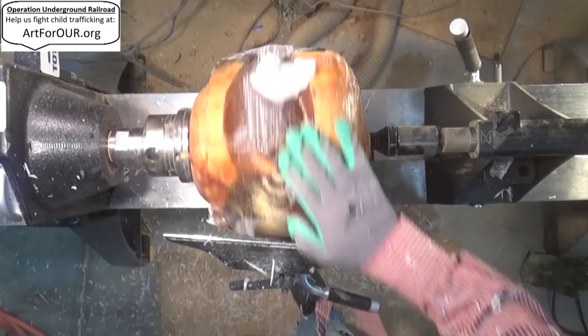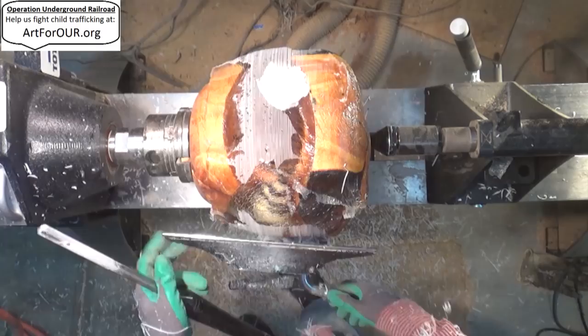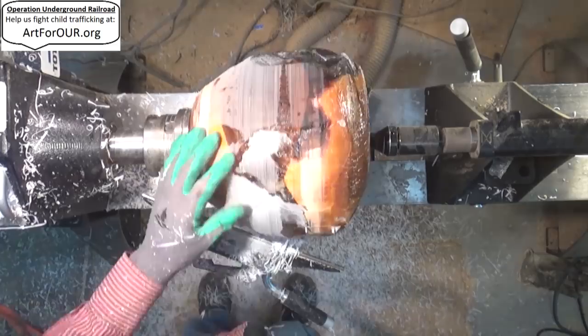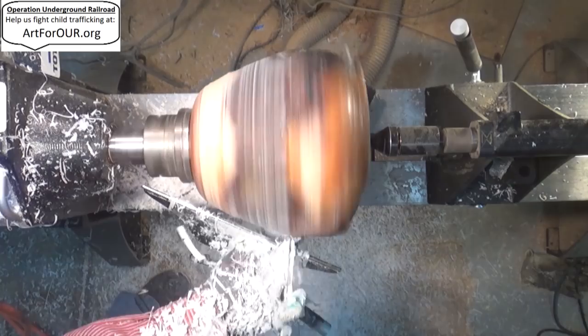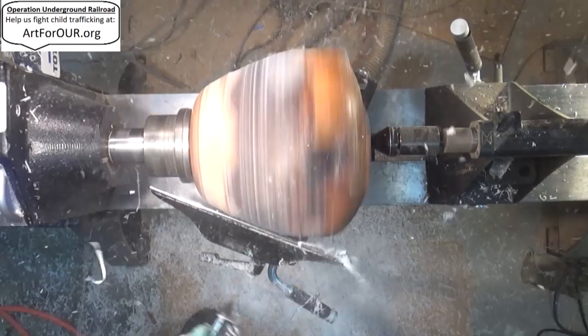And the reason I say that is when you pour it in there, you can check on it every few hours, and it looks absolutely crystal clear. There are no bubbles, nothing. But then bubbles show up. And I think it's because when the resin finally sets, there's some stage in that setting process that agitates the wood and makes bubbles show up. So this project finally broke me. Next time I'm gonna prep the wood.